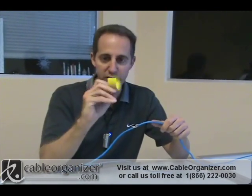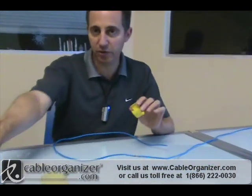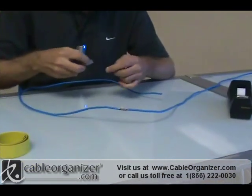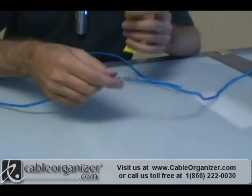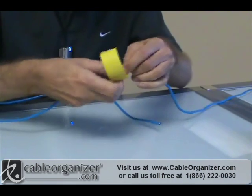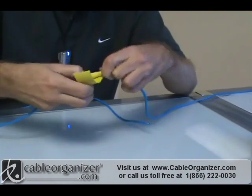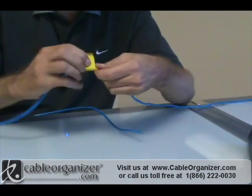It's a little awkward to use, so I'm going to show you some tips on how to work with this product. First thing you'd probably want to do is use a little bit of tape — take the tape and that'll hold one end of it so you can get the product started. I'm just going to wrap it around one end, then take it and start to wrap around the splice, wrapping it as tight as I possibly can — although we don't have to worry too much because we know it'll tighten up as we shrink it down.